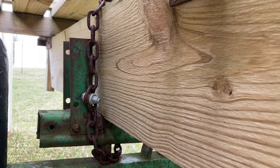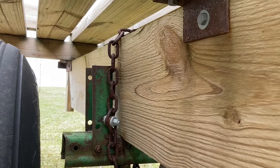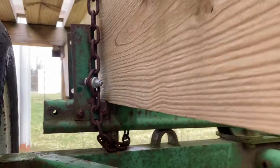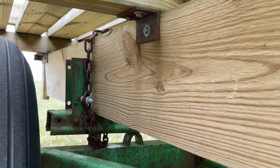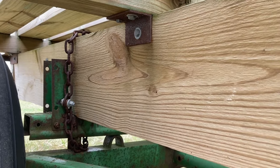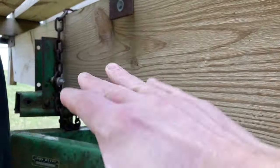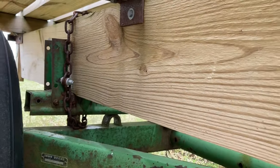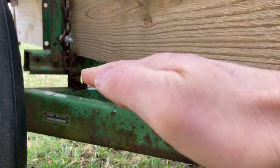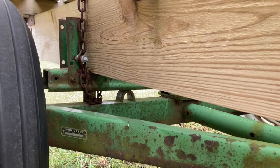Coming back to the rear axle is the important part — do not bolt that securely to the axle. I just put a chain over the rear boards and run that chain underneath the frame. The reason for doing that is we do not want the running gear to be completely rigid. We want this to be able to have some flex to it, so when we are going over bumps and dips in the field, this will allow the running gear to actually flex. If this were bolted solid on all four points, your running gear would not have any flex, and you could be tweaking things or breaking boards.